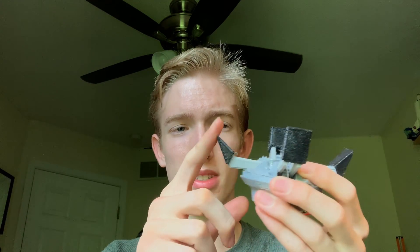I actually need to redesign two things on the robot arm. First, I need to redesign this — the motor I'm using is not strong enough to lift up much weight. It can pick up the little head itself along with this, but it can't pick up much weight beyond that. The second thing I need to redesign is this right here. I like the design, but it's a little flimsy and it only really works well for grabbing circular things like cups. If I'm trying to pick up anything else, it can't really grab onto it. So I'm going to redesign it and probably make a simple gripper — instead of four little fingers, it's going to have just two, and it should be able to grab a more diverse range of items.